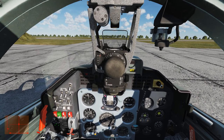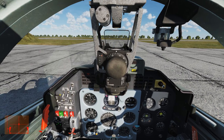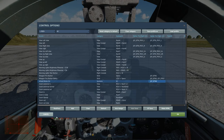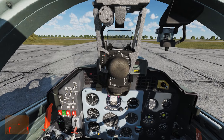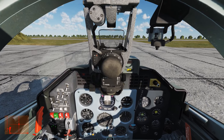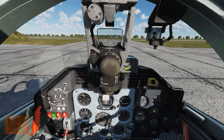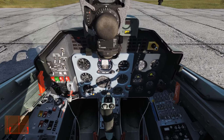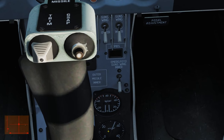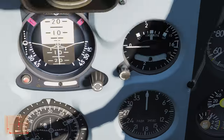We do it by method of differential braking. If we look at our control display at the bottom left, I'm applying the wheel brakes now through the both wheel brakes button — that applies both left and right wheel brakes. Now if I introduce the rudder for the left, you can see it differentially brakes so that only one side is braking. If I turn the rudder right then we've got that. That's also represented by this gauge down here which shows the hydraulic pressure of the left and right wheel brakes — rudder left and brake, rudder right and brake, that's how it works.